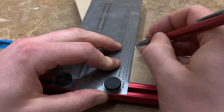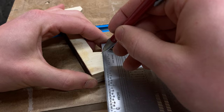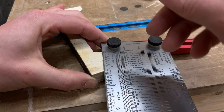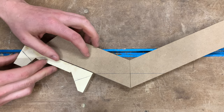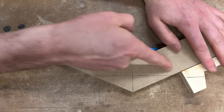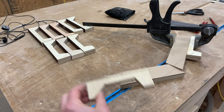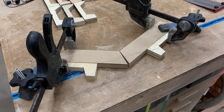I'll also make a perpendicular line on each clamping face. Bringing the clamping block over to the joint, you can see that the 45-degree face won't direct the pressure across the line I drew. However, using the 22-and-a-half degree face gets the pressure pretty close to exactly on that line. You won't get this perfect every single time, but one of the clamping angles should work better than the other. Once the block is positioned correctly, clamp it to your workpiece — one block on each side of the joint. Then place one more clamp across each block for perfect clamping pressure. It's really just that easy.